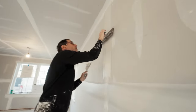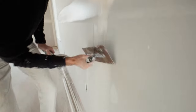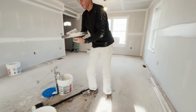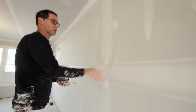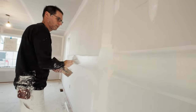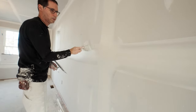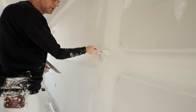Same with this — start right at the top, pull my trowel down. I grab a little bit of compound and blend that all in. Now, when the butted seams intersect, I could have done all my butted seams first thing in the morning, and then by the afternoon run the other seams through — it'd be a little easier. But this is how we're going to do it today. All I'm trying to do is blend that in and have it come out pretty good, because this is the fill coat. And I'm happy with that.